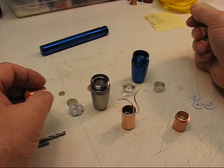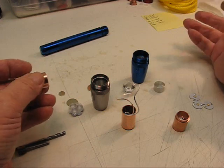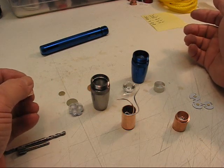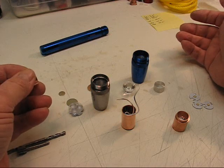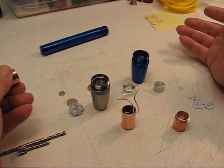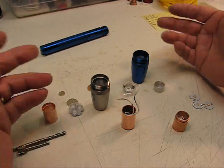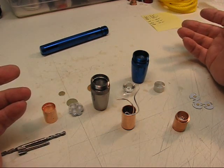I've done quite a few of the incandescent style. The LED heads are longer heads, so it gives a little bit more room to have a driver in these lights, whereas the incandescent, there's so little room that basically they're a direct drive light — there's no room for a driver. With the LEDs, I can afford to pop a driver in them. So I've got two different ones I've been working on, and I just wanted to show you a little bit about how I'm doing it differently.